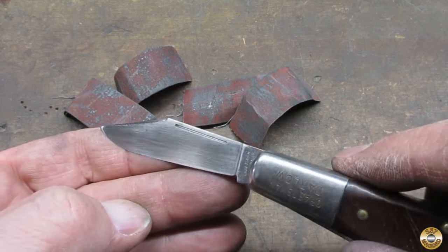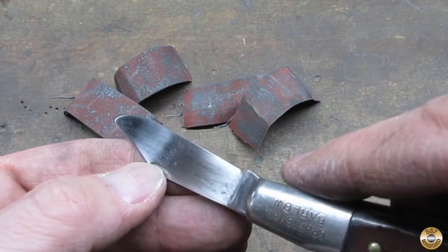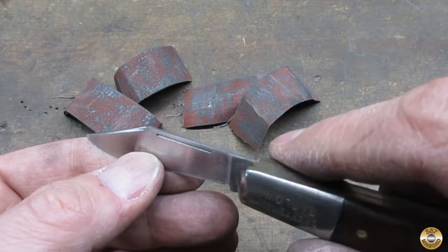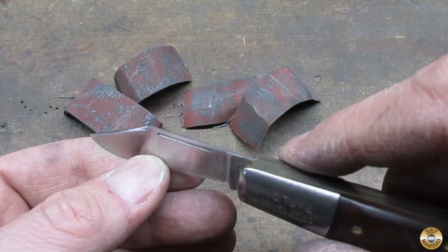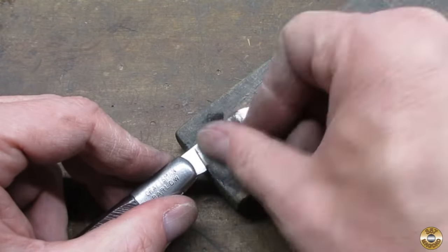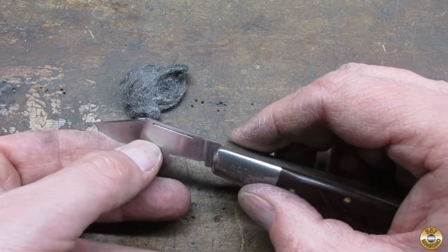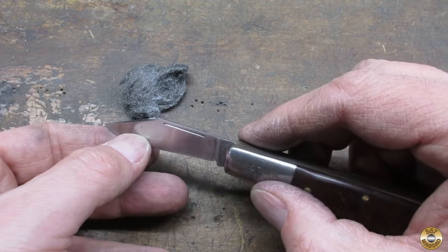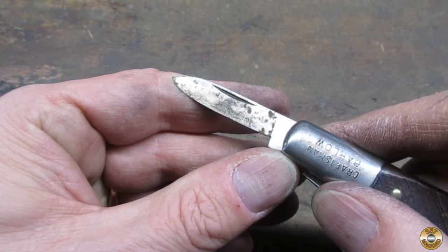The main blade is sanded down to 600 grit. Looks pretty good. Now I could get out the wet and dry sandpaper and go down to like a thousand or 1200 grit, but I think I'm just going to take some superfine steel wool and polish it with that. I think that'll be good enough. The superfine steel wool did a pretty good job — that's plenty polished for an everyday carry. Chuck and I will probably go over it with his favorite stuff too. I'm going to repeat that whole process with the smaller blade.